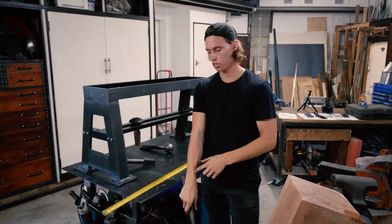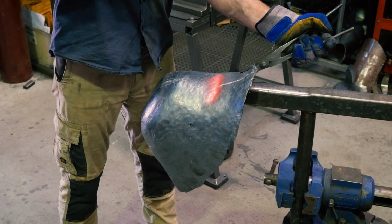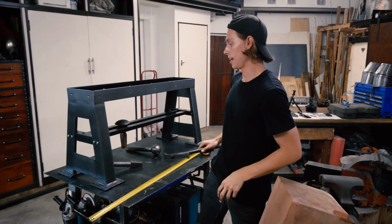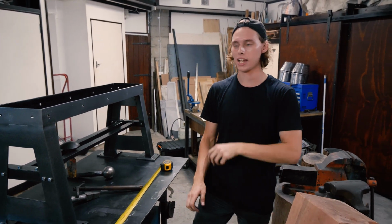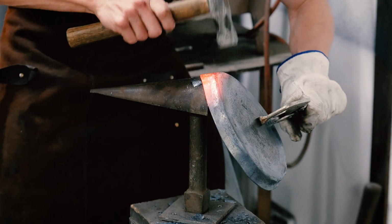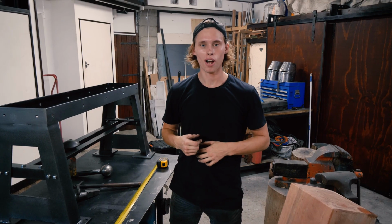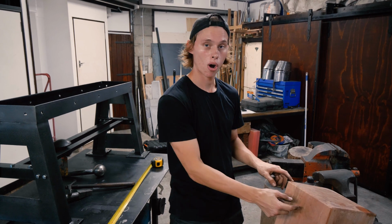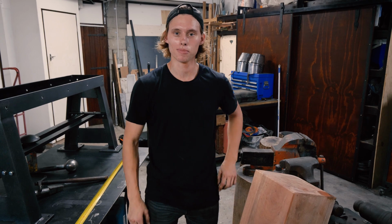Now in forging, that's usually down here around wrist height. Armoring is a little bit higher. It's a little bit of a difference between blacksmithing and armoring. But all that said, you want to make sure that the timber or the plate that you're going to be using to put the stakes in and the frame that it sits in end up being at the right height. For me, that's 750 millimeters, whatever it is for you, find what that is and get the project done. Now, let's get on to putting some holes into our piece of timber to mount those stakes into so we can get started doing some armoring.